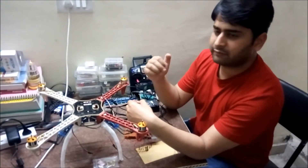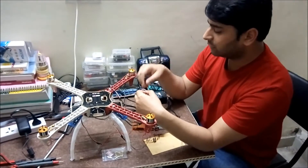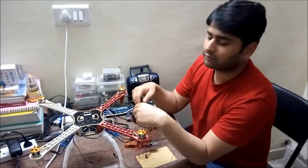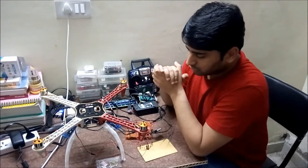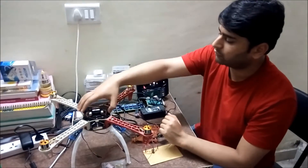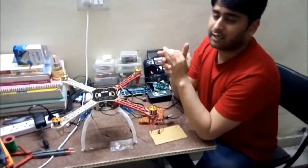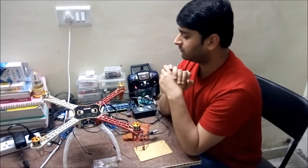There are three pin cables coming from each electronic speed controller: a white wire, a red wire, and a black wire. Black is ground, red is +5V — and this +5V is not supplied to the ESC, rather it is output from the ESC powering the microcontroller. The white wire is the PWM wire which receives the PWM signal from the microcontroller. Next, we will wrap up the whole circuit on a small PCB which will be mounted on the drone. We will also add GPS modules, GSM modules, a camera, and of course the battery. In the next video we will show the drone flying.